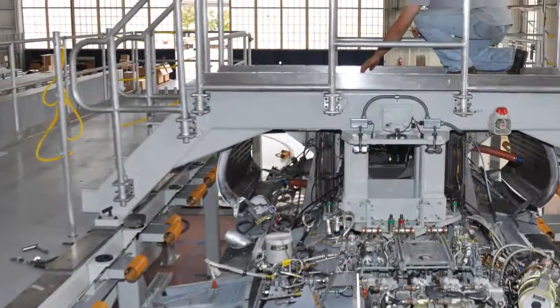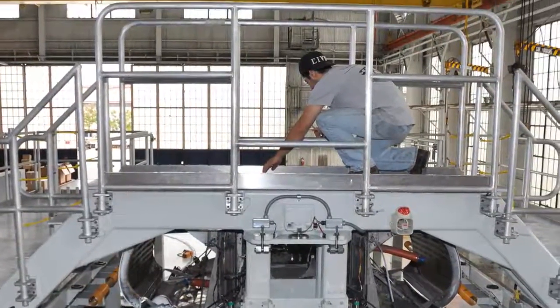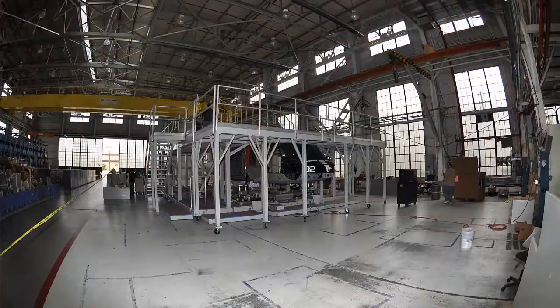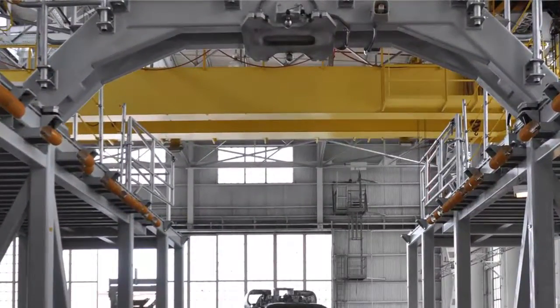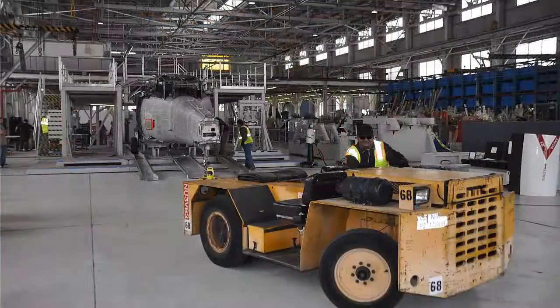Designed specifically for these aircraft, the repair system features extendable deck slides and access for upper aircraft measurement and repair. The system can be configured according to depot hangar requirements. The standard LTAA configuration relies on an overhead crane to load the aircraft. The R version of the LTAA offers the convenience of ramp loading for aircraft with operational landing gear, or cart loading for more severely damaged aircraft.